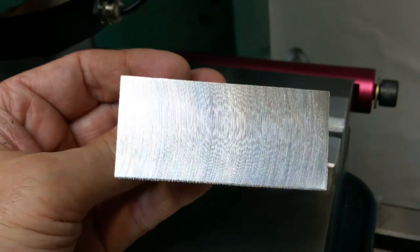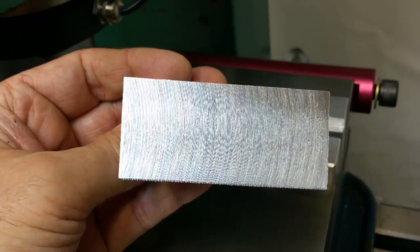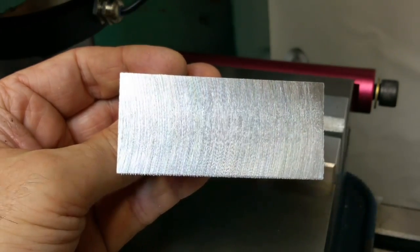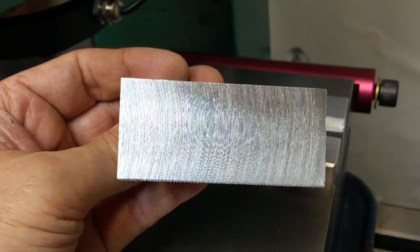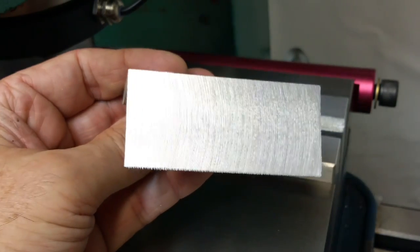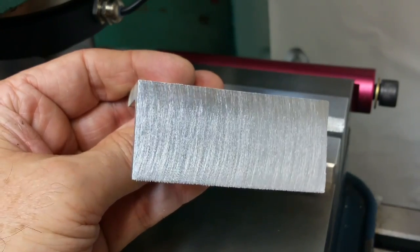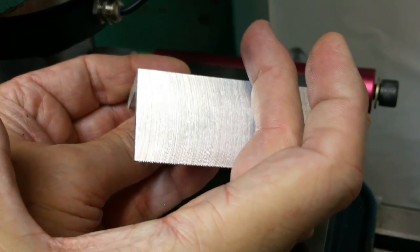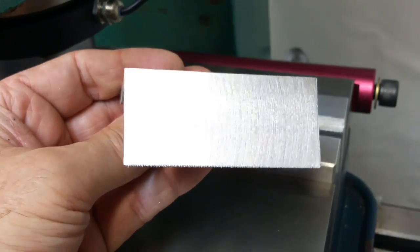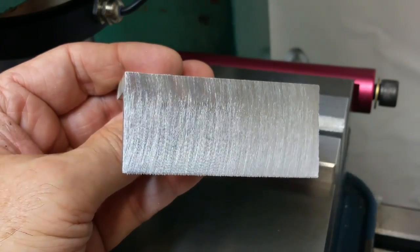I have noticed in the past that this will be almost a linear cut. The diameter on this cutter is so large compared to the size of the workpiece — that ratio is important in trying to get a good crosshatch pattern. What I expect to happen is fairly subtle. I won't have a pattern where you can actually see a whole lot of curvature to the cuts. Because the radius of the cutter is so large, you'll end up with very gradual lines — not a sharp scallop line. So that'll drastically affect the visual and the physical pattern you get for the grippiness.